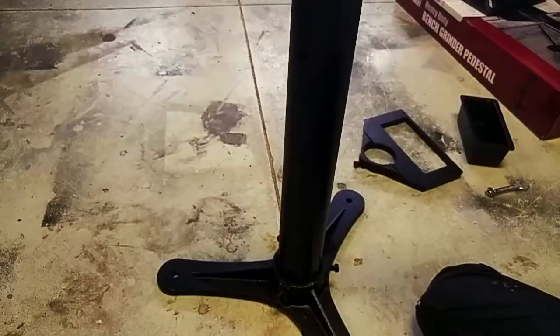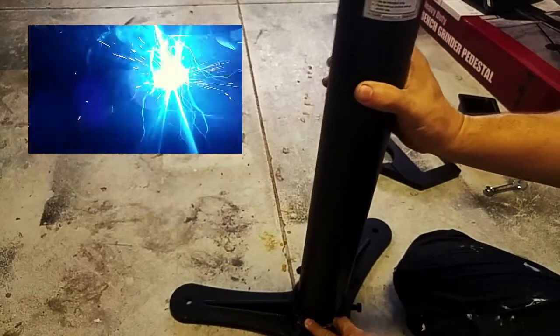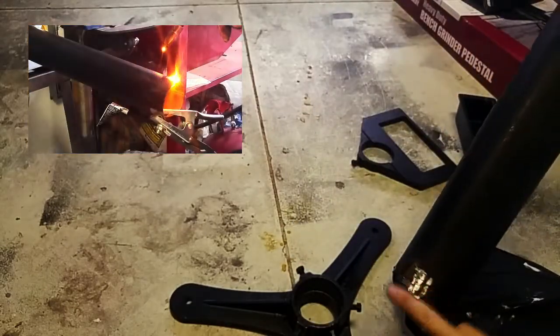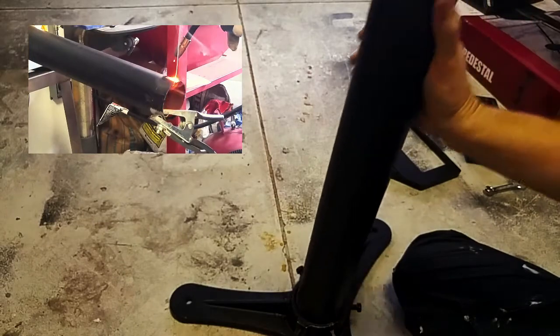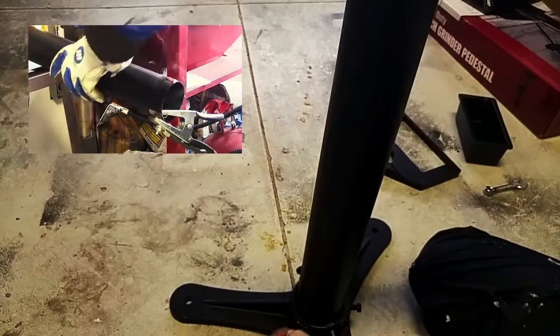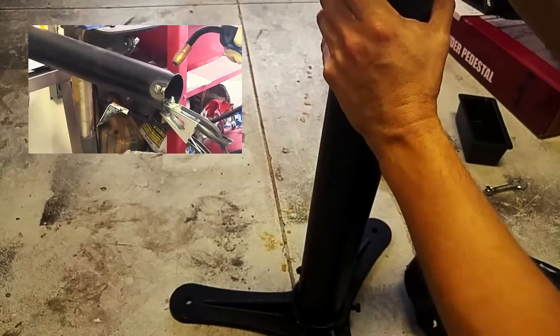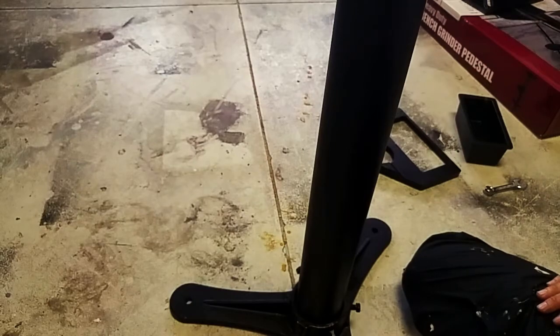more secure. Now if you look toward the bottom, I also think it's a good idea to add some spacers. Again, I just welded it and then ground it down so it fits smoothly, and this is now a lot more snug. I'm still going to have the problem where if I tighten it, it'll deform the metal, but I feel better that this is nowhere near as loose as it used to be. I'll still be able to adjust the angle a little bit the way that it is, but it's just not going to fall around and flop around in there the way it was before.